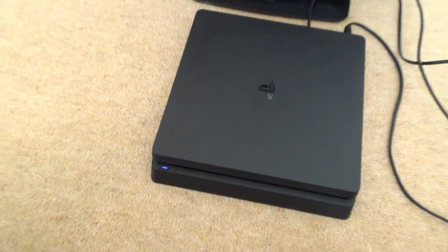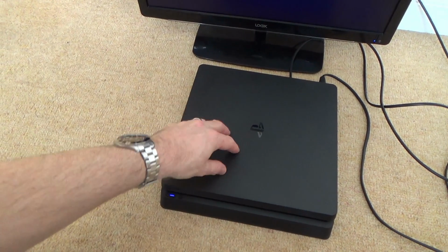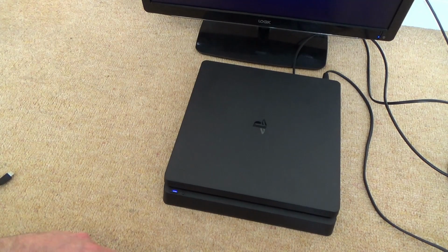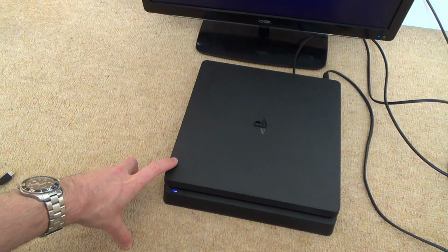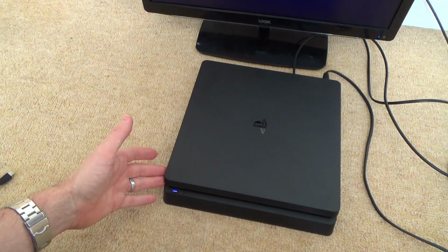So do you know what I'm sort of thinking? I know that on the older PlayStation 4, you can do a bodge where you put washers on to put pressure down on the main APU. And it's a kind of short-term fix. It might work a day, it might work a week, it might work a year. Now, the thing is, John will be getting the PlayStation 5 when it comes out, so even if this was only to work for so many months, it would still be better than nothing.